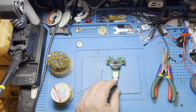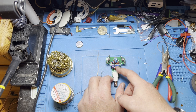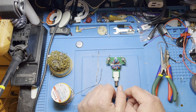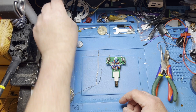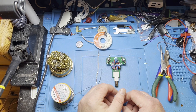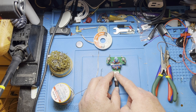We're going to start taking this thing apart, figure out how the traces go, and make it into a 1-to-1 balun. Not sure if we're going to be successful. I have some solder wick here but I don't have any flux, so I'm going to try to do this without flux. If I'm not successful, I'll need to go out and buy some. You won't notice anything, but I might spend a little bit more time making this video. Let's just go straight ahead and do this.